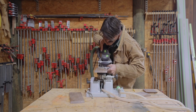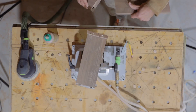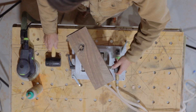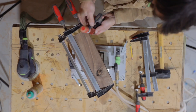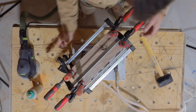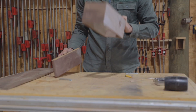I'm using a domino here but feel free to use whatever tool or technique works best for you. Something I don't show here is you're going to want to go ahead and check this for square before you completely tighten up those clamps. Once you take it out of the clamps you're going to want to use something like a sanding block just to give it a good once over, making sure that the skin or the lid fits real well on there.